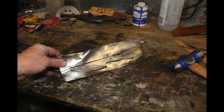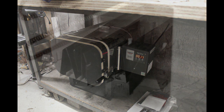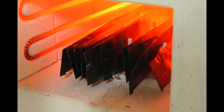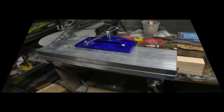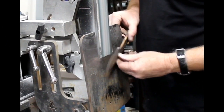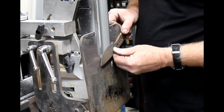The next process is heat treating — I'm not going to go through the whole process, but for stainless steel you wrap it with tool wrap and heat treat it in a heat treating oven. AEBL gets heat treated at 1960 degrees for 15 minutes. Then I plate quench them — I clamp them between two pieces of aluminum tubing and blow cold air through a compressor to bring down the temperature. They also get a sub-zero quench and two tempering cycles in an oven.